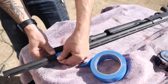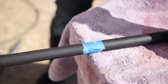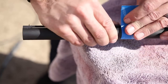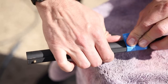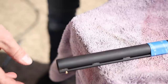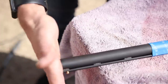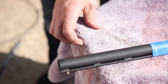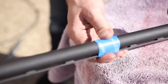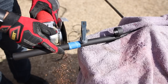I taped it off as a general placeholder, but as you can see I didn't do a very good job taping it square, so let's square it up. The cool thing about cutting down a shotgun barrel versus a rifle barrel is that there's no rifling inside that we have to worry about crowning. With a rifle barrel, the gas flows through the rifling to twist the bullet, and every portion of the rifling needs to release gas at the exact same time for accuracy. With a shotgun we have a smooth bore, so we can just grind it down as flat as possible and it won't affect our pattern.